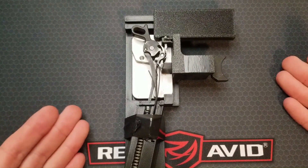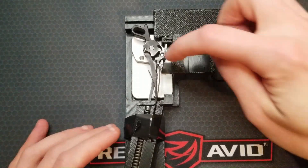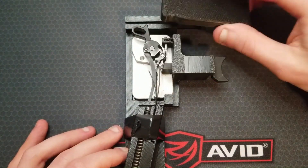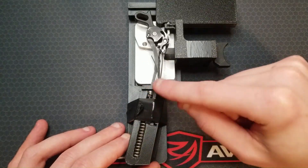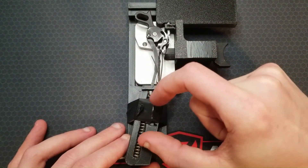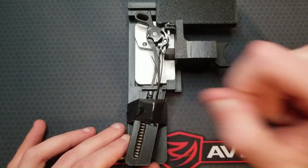I designed and 3D printed this fixture that holds all the other components close to where they would be in the pistol, around the sear and the hammer in this little jig right here. I've also made a representation of the slide. The main spring is further away from the hammer strut to reduce spring force — not a lot is needed for this demonstration. This main spring would normally be compressed in the main spring housing and then moved closer up to the hammer strut.